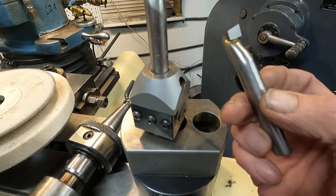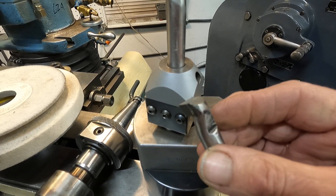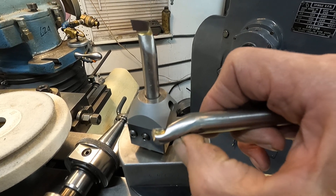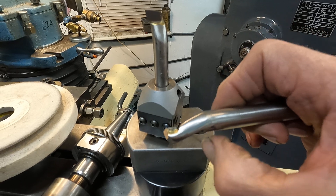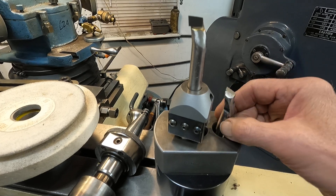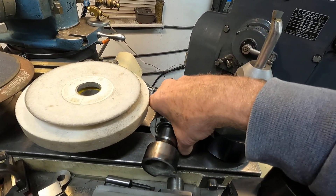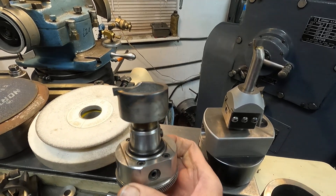It's really nice — I can change the angle on it. I brazed a pretty thick piece of carbide, took a half-inch piece of steel, heated and forged it, and bent it so I can get the carbide on center at the right angle. Here's another one in a little square head.